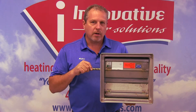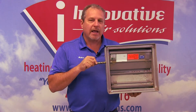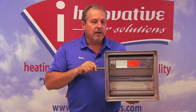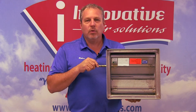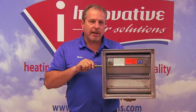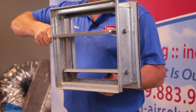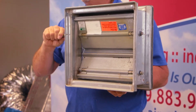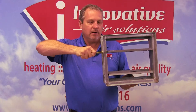What happens is we will cut a hole in the duct and we will slide this damper — this is called a damper — inside the duct, and we can use this to control airflow downstream. So we could have a house with two stories where we want to cool or heat just the upstairs. We install this damper and it will open to allow airflow in and it will close off. This is called an opposed blade damper, as the blades oppose each other the way they rotate.